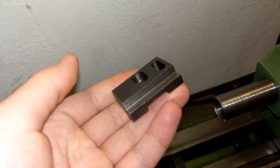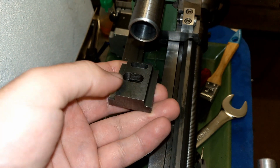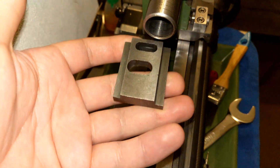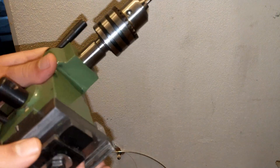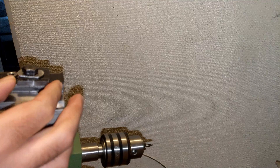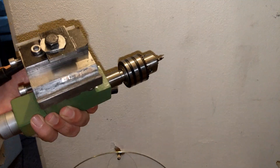The reason I couldn't use the original part is because the plate I added doesn't allow this plate to fully clamp under the bed. As you can see, the locking plate doesn't look good — although it does the job and locks the tailstock in place, I don't like the way it looks. So we're going to make a new one.